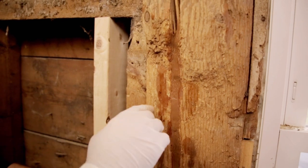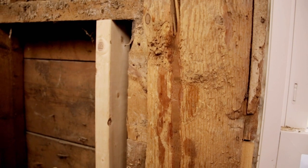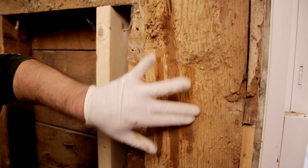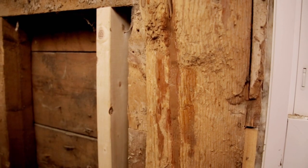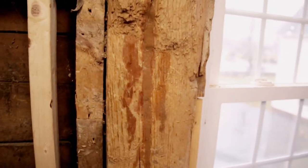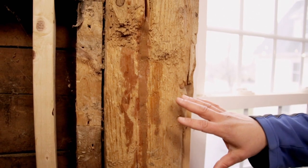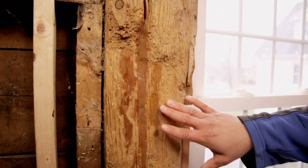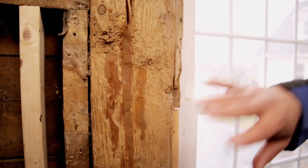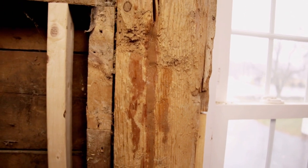As you can see here, there are a couple parts on this beam where it's natural wood and it almost blends identically with the tint I've used. And if you plan on poly-ing your beam to see what it's going to look like, you can actually take some water and rub it on — that's actually what it's going to look like with the actual poly. It's pretty identical. I think it looks fantastic. We're just doing a straight poly here, not staining the beam. Once the poly goes over the stain itself, it's even going to darken it up a little, so the crack will be irrelevant at that point — it'll just blend in and give a good finished look.